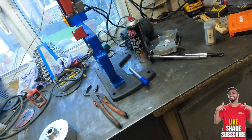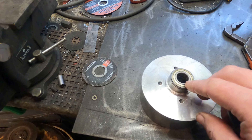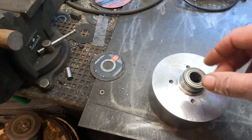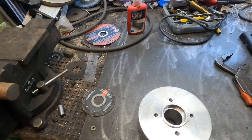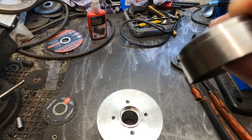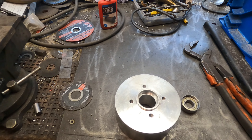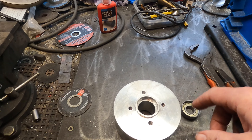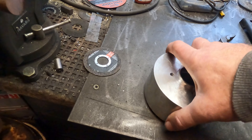I've turned that bush for the old bearing — the new bearing — so that will fit in there nicely. I'll put that aside. That's where the bearing goes, halfway on the bush. I'm not going to press that home, I don't think it needs much of a press. I would need to put a bit of Loctite on there.